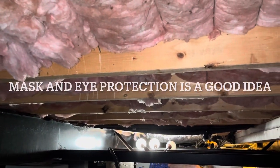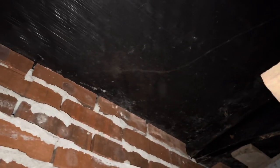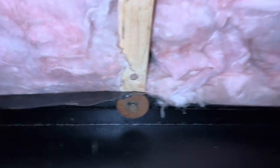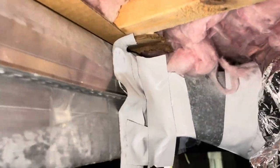So that's how you hold your insulation up under your floor joists. Remember, this did look a lot different when it had the underbelly. This is their original underbelly. We didn't cut it out on the outside edges — all we did is pull the insulation out. Now we've pushed the insulation back from here all the way back to the inside, because I did not want to cut the underbelly out on these outside edges — it would be too hard to put back. So in here we're going to put it back to the floor joists. We left a little bit of this plastic sticking out so that we could run our new closure. But before we do that, we're going to make sure all these are sealed, and we're wrapping these completely with insulation and then probably insulation board.